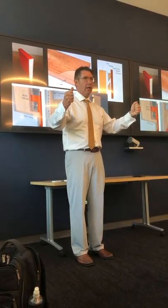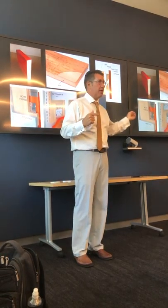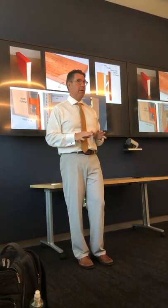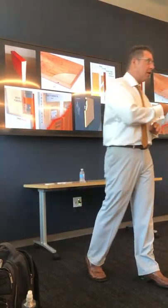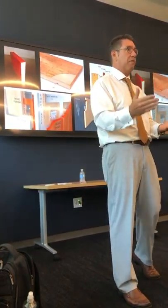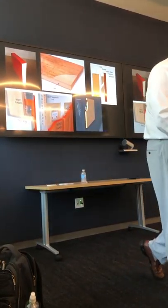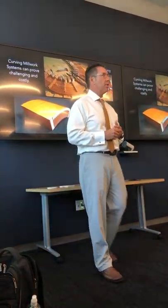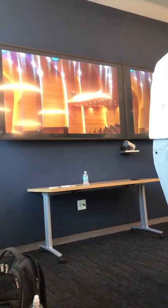This is why millwork starts around $40 a square foot. The labor rate to install all this is around $15 a square foot — that's just the labor. People don't realize that spraying three coats of lacquer or urethane costs the millworker anywhere from $6 to $12 a square foot — that's not the veneer, that's not the panel, that's just the spray coating. And if you want radius work, that's another premium because curve cores aren't cheap.